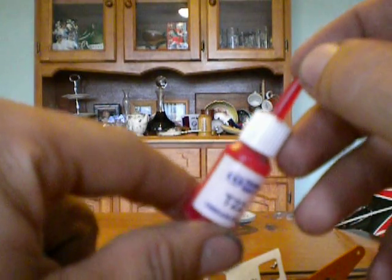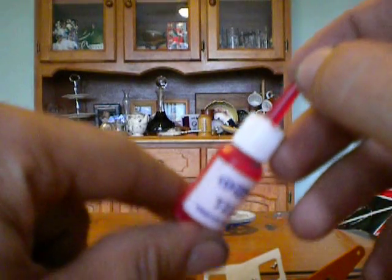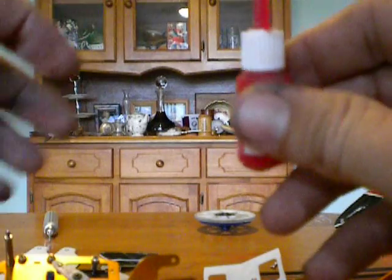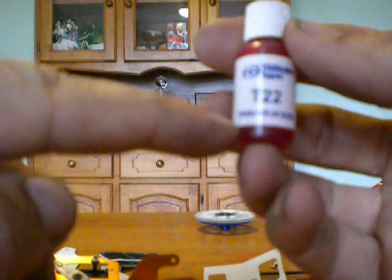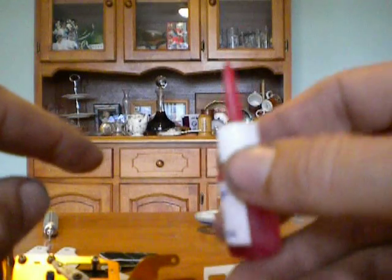All you need is light or at most medium. If you use higher, the bolts will bind so tightly that you'll probably damage all of your components trying to release them. On an electric there is not much vibration anyway, so it's not that critical. Also, the smaller your thread, the less strong you need your Loctite to be for it to have the same amount of lock.